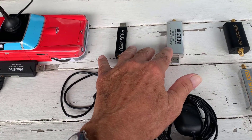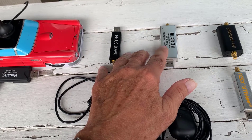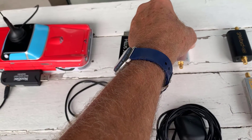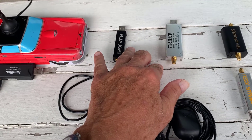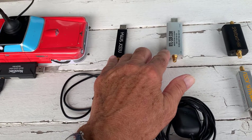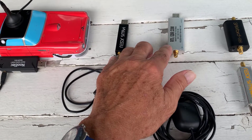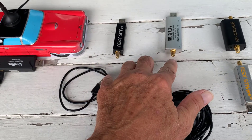The next one is the version 3 from RTLSDR.com. It has HF capability — you have to go into direct sampling mode — and it's also got an SMA connector. This covers HF, going from about 100 kilohertz up to 1750 megahertz. The HF works on direct sampling at 28.8 mega samples per second, so whatever signal you receive is mirrored about 14.4 megahertz, which you have to take into consideration.